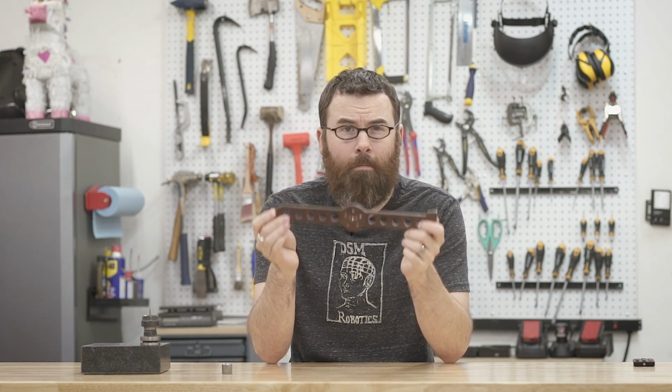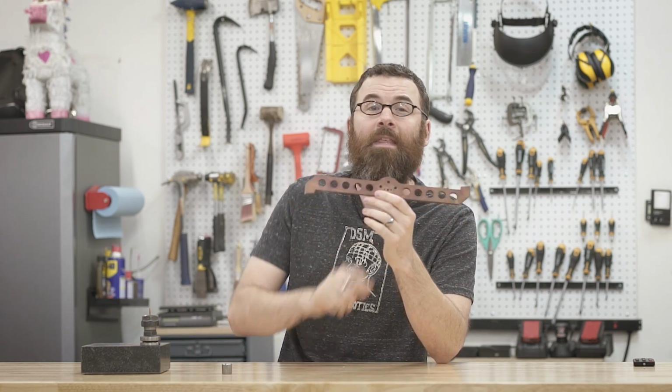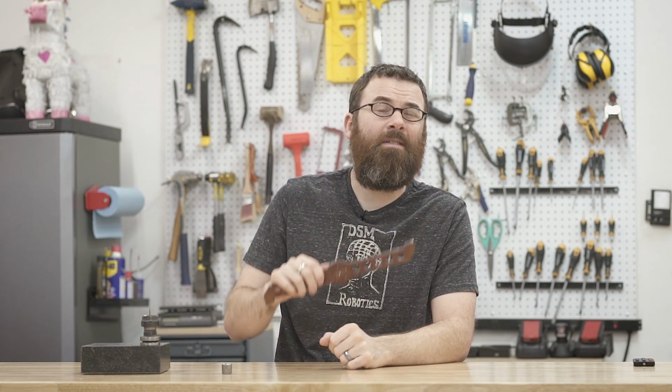In this video, I have a relatively straightforward project. I need to take the weapon bar for Psychotic Break and start doing some modifications. I was testing out some ESCs and I realized that to test this properly, I need to finally open up the center hole. Currently, it has a hole down the center that is 5 millimeters, and I need to open that up to accommodate the needle bearing, which is 0.75 of an inch, or about 19 millimeters.